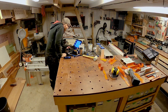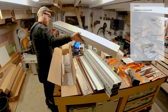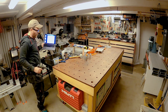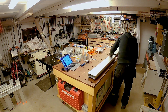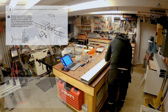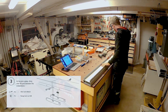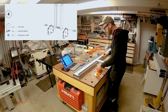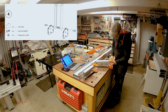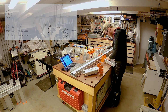Now I'm starting to assemble the rail sections. This is the part of the build that I felt was the most flimsy. First of all, it's pretty easy to get it misaligned, and secondly, it doesn't really hold together on its own. It's held together with some internal aluminum X brackets and some steel braces on the outside. The parts I'm assembling here make up the struts that you slide onto the log lifters when assembling the mill in the field.